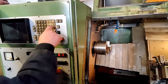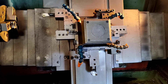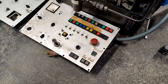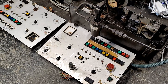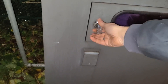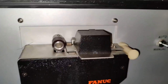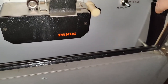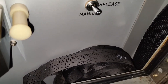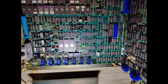When I bought the machine it actually still worked, so I was shown all the features and could play around with the buttons on it. Apparently one of the previous owners had three of these machines and at one point merged them together — that's why I have a lot of spare parts. So the machine works and I have lots of spare parts. Why break it? To understand that, we should look at how the machine is programmed. You have to type in movement commands by hand on the keyboard next to the display, or save it on data storage. I first thought it used a tape drive but then discovered it uses ticker tape. I want to program this machine with a CAM programmer, not by hand, and therefore I need to connect it to my PC — and that's why I replaced the controllers.